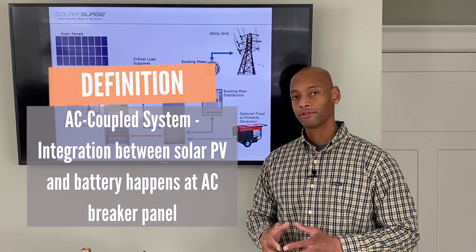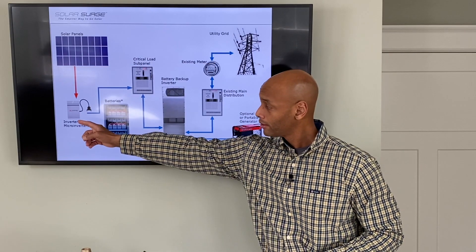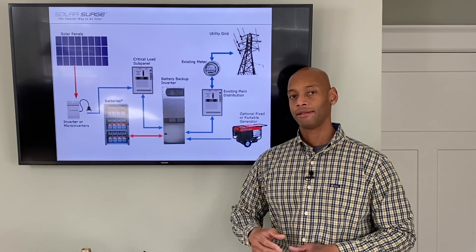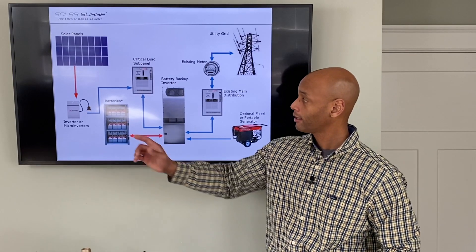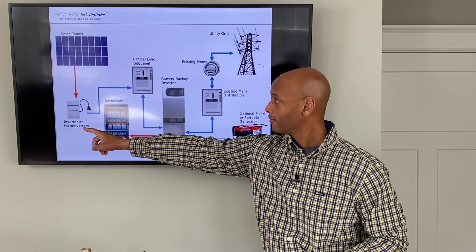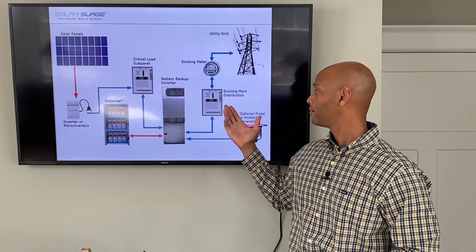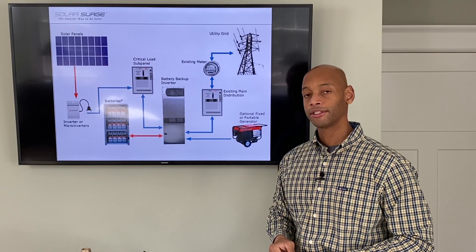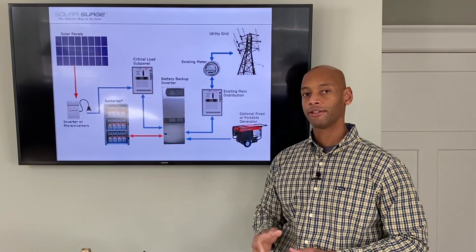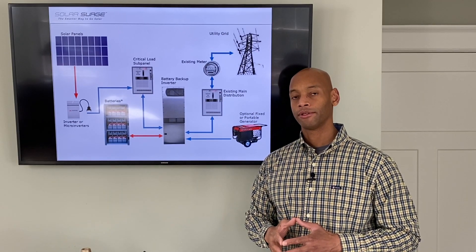You have your existing solar panels — on the roof or on the ground. On that system you're either going to have microinverters, where you have a small device underneath each solar panel to convert DC power to AC power, or you may have a central inverter that converts for the entire system at ground level. That output from the inverter is typically delivered directly into your main service panel, where any circuits in the house can consume that electricity, and once the needs of the house are fully met, all the excess gets pushed back out to the utility grid via the net metering process.